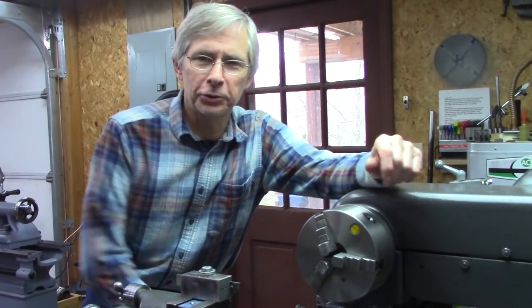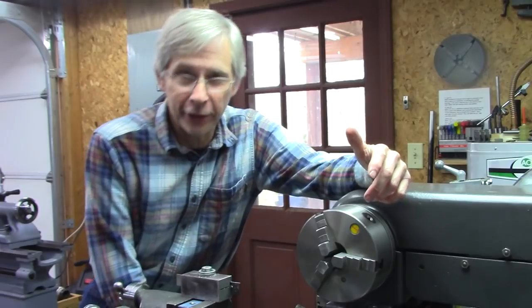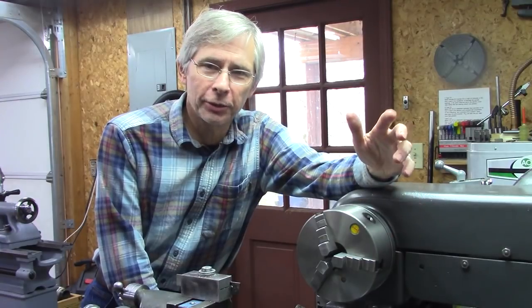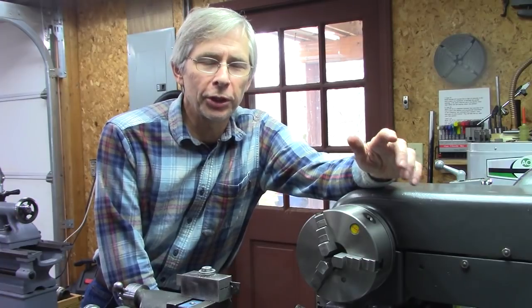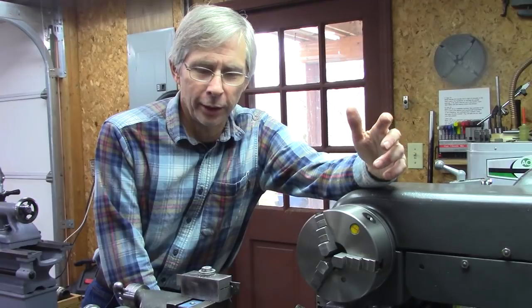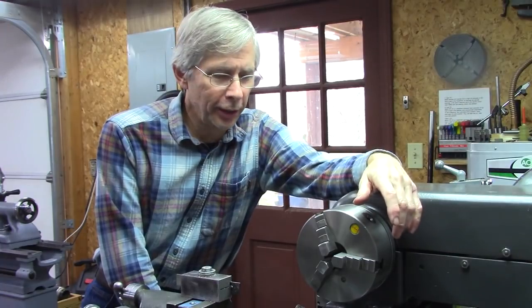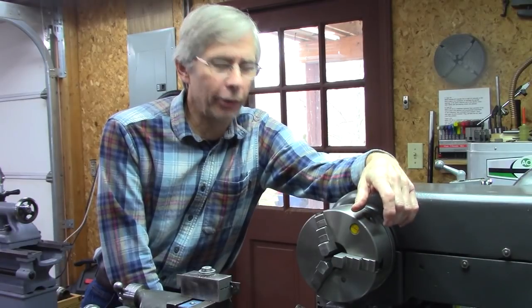That just about wraps up another episode of chuck overhang. I know there's going to be some comments like learn how to adjust your lathe, or you need to check your bearings or whatever, but that's really not the point I was trying to make. The point is that chuck overhang is something you need to consider. There's always things you can do to make chatter better — increase feed rates, speed, adjust your gibs, check your bearings — it's a huge list. But chuck overhang should be near the top of that list, at least on a smaller lathe. Anyway, that wraps it up and thanks for joining me. Be sure to subscribe.